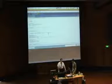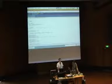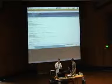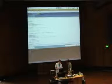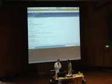One of the little quirks about these particular Dallas chips is that they always report 85.00 degrees the first time. Basically, it's like saying, hey, I'm here. But you have to ignore the first value if you're reading it immediately after startup. So what we've got there is a read every 5 seconds, and it's currently around 28.18 degrees.